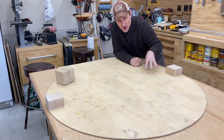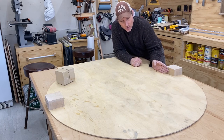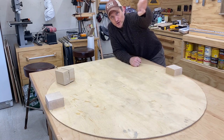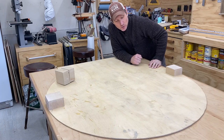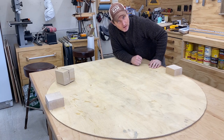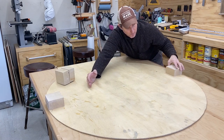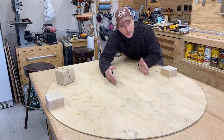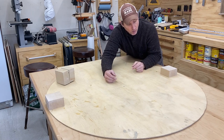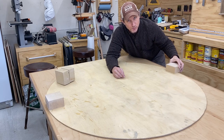You need to understand this because the tool you're going to make will be creating a perfectly circular arch. You need to make sure you have the proper length of your tool, because if your tool is too short, it's going to end up creating a circular pattern that is smaller than the diameter of your oven, and that might be a problem. Also, if it's too big, it will make a diameter that is larger than you plan for.